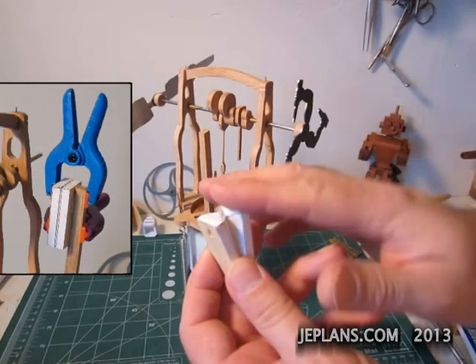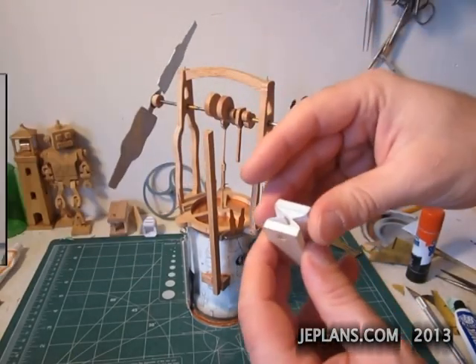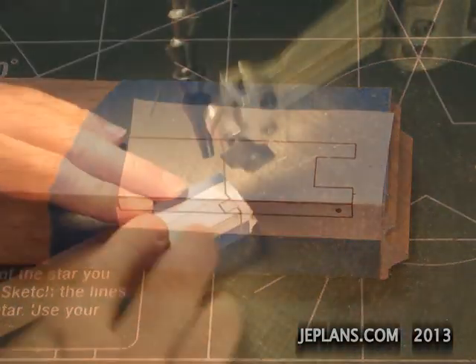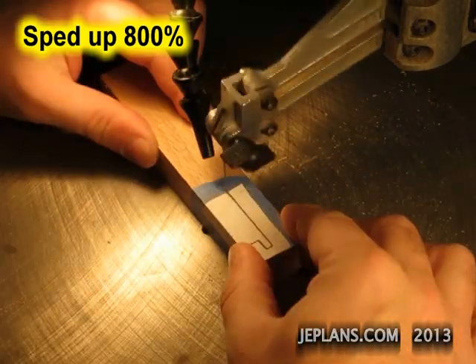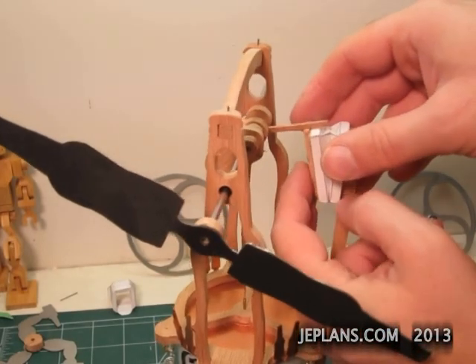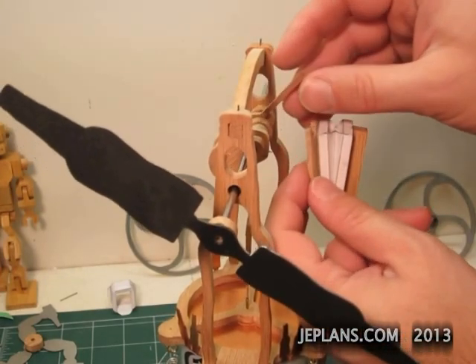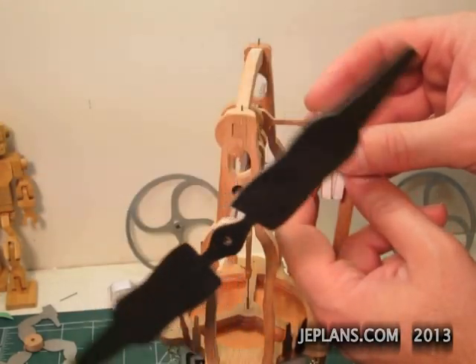Because this is my final attempt at the bellow, I'm going to simply glue it right on. I'm not going to make my clamping apparatus for it and see how it works. This is the attachment to connect the bellow to the connecting rod. This piece we just cut out is going to simply glue on the side of the final bellow. The connecting rod has multiple holes in it so you can find the optimum position to attach it.